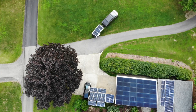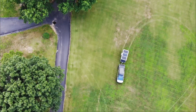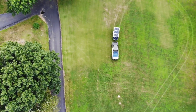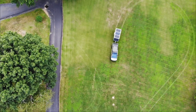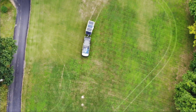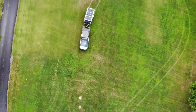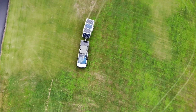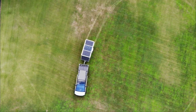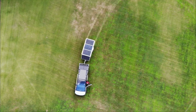I could put two of those panels in series. Since I have two EG4 6000XP inverters in parallel on the back, I actually have two extra PV inputs, so I could put several more panels on there. You can't see it, but underneath the panel mounted on the back of the Cybertruck I built a frame out of 8020 — that's extruded aluminum, like erector sets for adults.